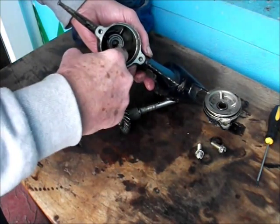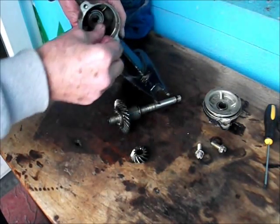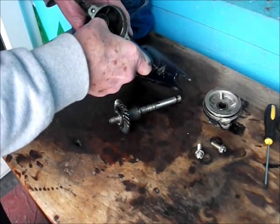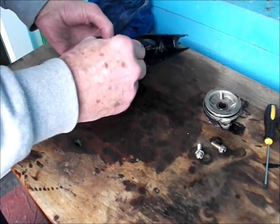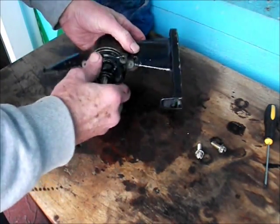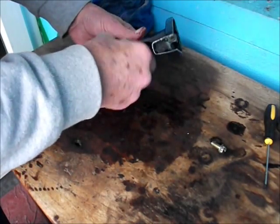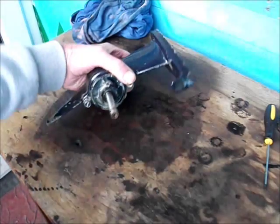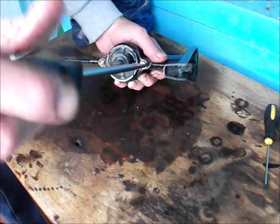Reassembling it now - washer first in place, followed by the flat needle roller bearing, followed by the cog with angled teeth down, and followed by the shaft which we've already put the needle roller and washer onto. So if the shaft wasn't there you could see both needle rollers in place because the washers would be underneath them. Trying not to get mixed up explaining that - I'm sure there's a blow-up diagram on the net you can easily find.